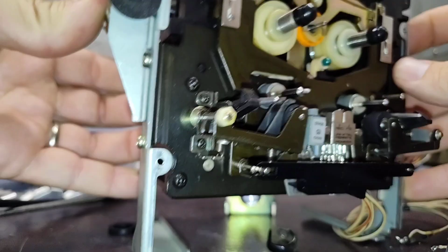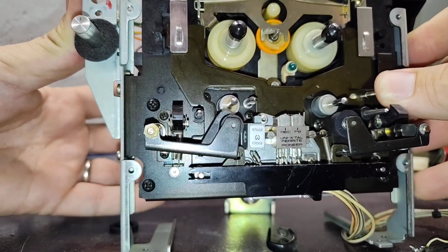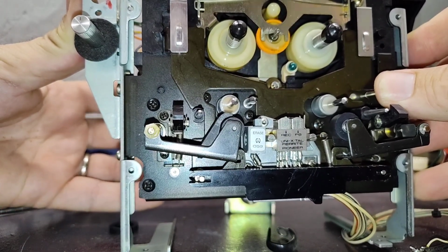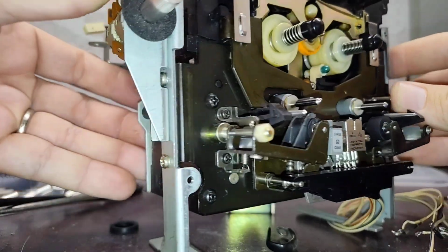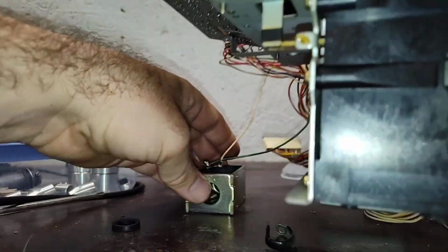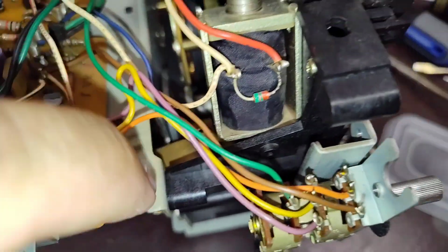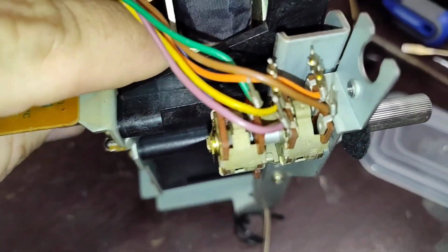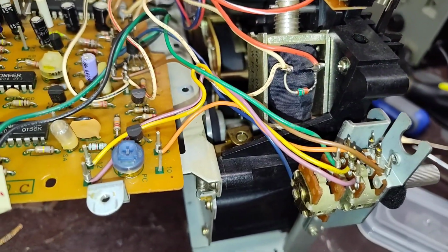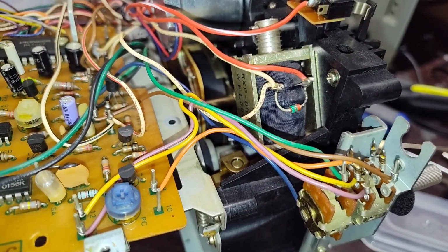So if we can pull back on that solenoid with the lock disengaged, you can see the rollers come up like that. You're doing good. I just loosened something, so that's not good. But normally the solenoid holds that in place, which we're going to install in a moment. What comes loose is you can see it coming up on the shaft here, so it needs to get pushed back down into place. Once we get that there, we'll remount the solenoid, which should hold it there, and then we'll have less issues with that.